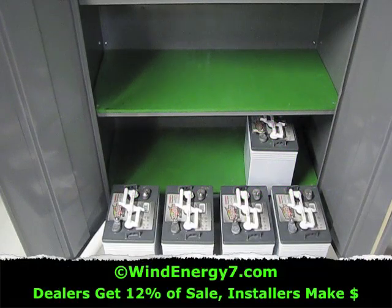Here I've got my battery cabinet reinforced in place and I'm starting to assemble the batteries and do the cabling. Usually I'll lay these batteries out like this, space them out, and try to get an idea of exact cable lengths, because I'm going to have those cables cut exactly to the right length so I've got a really nice clean installation. I'll lay this thing down, figure out what's going where, and get ready to cut my cable lengths specific to what's needed.